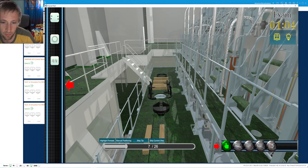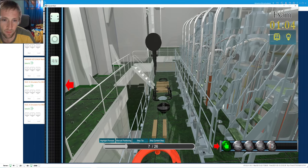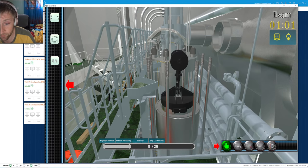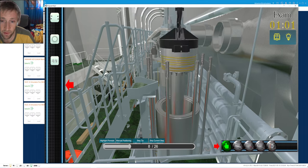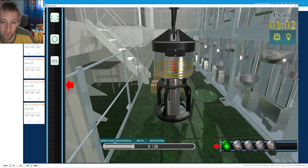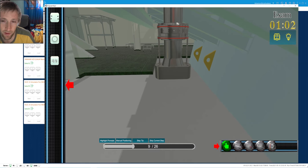We will bring the crane and pick up our piston lifting tool. We make all the checks around because the piston is really heavy and tightening must be proper. The piston is already tightened and now we have removed it together with the stuffing box. The stuffing box lays down on the rods.